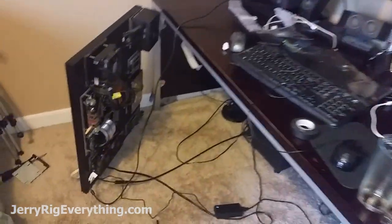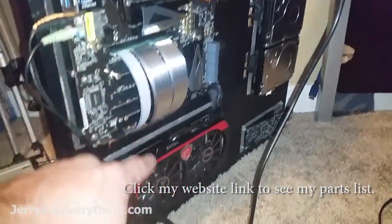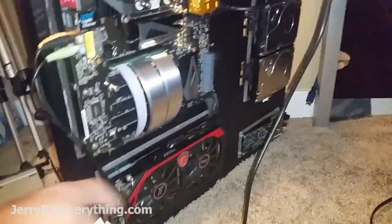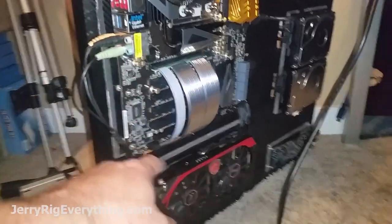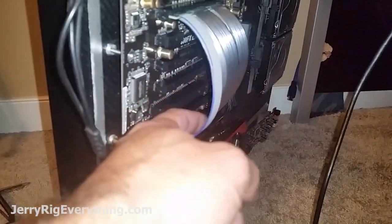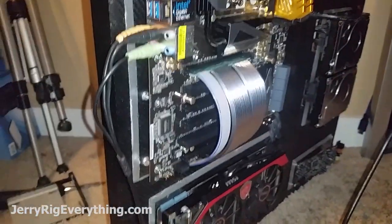Here's my workstation where I've been the last couple weeks. I've been waiting on a shielded PCI cable — this one going down to my graphics card. The daisy chained one I had before wasn't really working out; sometimes the error code on the motherboard would pop up that the display wasn't reading. I figured they were getting some kind of interference probably where the PCI cord comes down close to the motherboard.